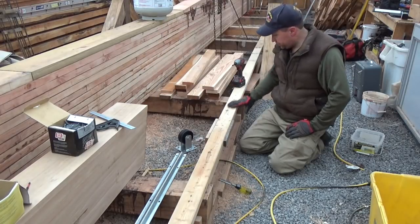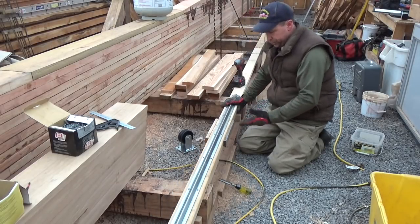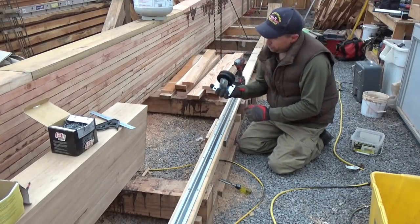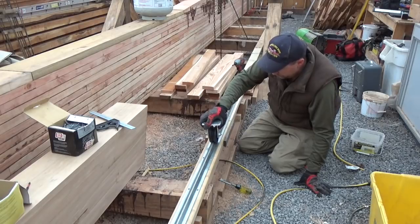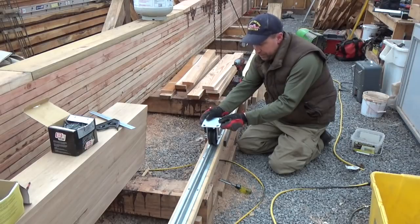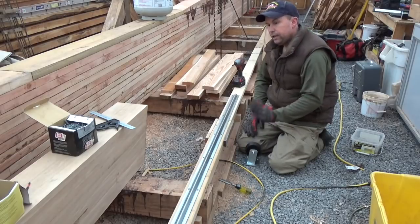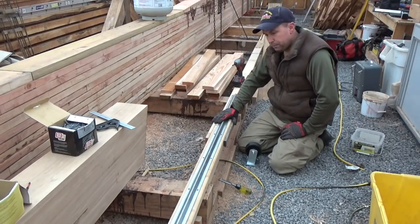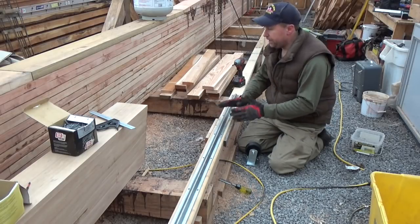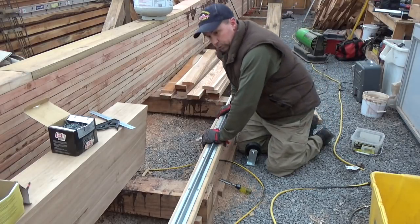Now, once we run this layout all the way down, we pull out our V-track, which is just like 12 gauge galvanized steel folded to have that ridge in there, and then with our V-groove wheels, they'll just ride on there. How we attach this to the gantry crane, I think I have an idea, but we're still working on that, but then it'll just roll back and forth. I'll have to be very careful on the opposite side to make sure that these two tracks remain parallel. Obviously that's going to be critical, but once we get one side done, we can work off this fixed side to make sure the other side is parallel. I'll probably have to build a jig or something to make sure that works out. So we'll just keep on moving down the line.